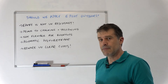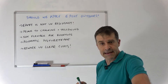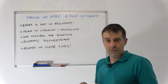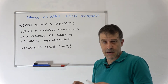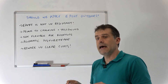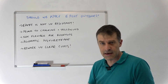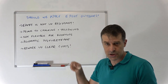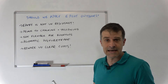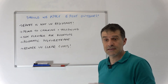One more point: many people believe you can just take an aliphatic clear coat, a transparent coat, paint it on top of the epoxy, and therefore protect it from UV. Let me tell you — that will not work. You apply a UV resistant coat over the epoxy assuming it will stop the sun. Yes, it may delay the yellowing and the chalking, but eventually the sun will get through the coating, reach the epoxy, and destroy it, destroying the whole system. A UV clear coat might work indoors to extend a floor's lifetime, but outside it will not save your epoxy from chalking.